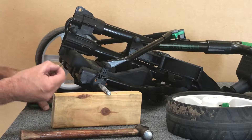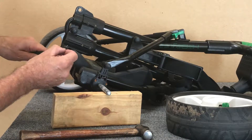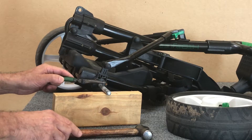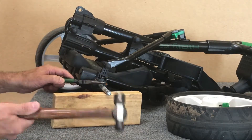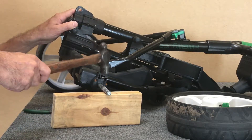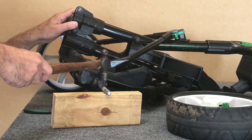This is your pin. To be on the safe side, it's always good to hold it with some needle nose pliers. Hold that directly over the hole. Hit it with a steel-faced hammer to get it started, then continue to hit it until it's equal distance sticking out both sides.